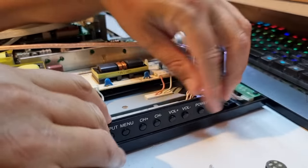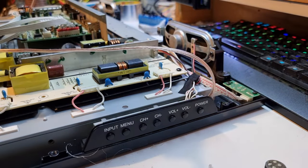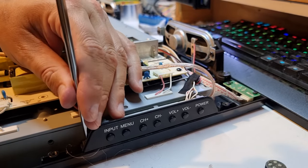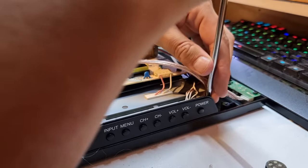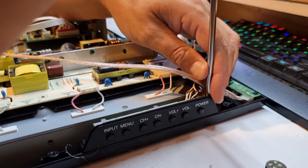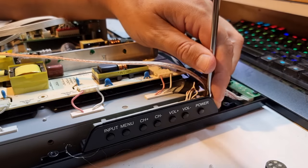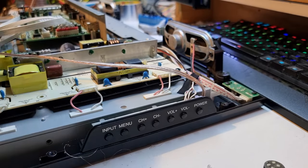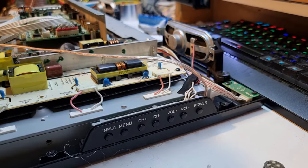Alright, we will screw this back in position with a couple of screws such as these two over here, and then we will begin the reassembly process and find a way to route this cable out of the case. I'm doing this one blind over here. Well, there we go. And remember, when you're doing plastic standoffs like these things, you don't need to over tighten them. I get so many of these things where these plastic bosses snapped out. Just be gentle. It's only plastic, guys.